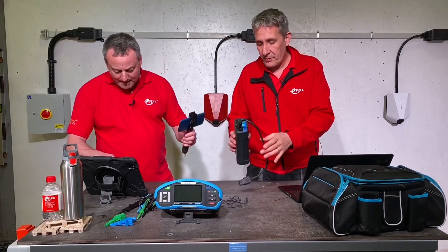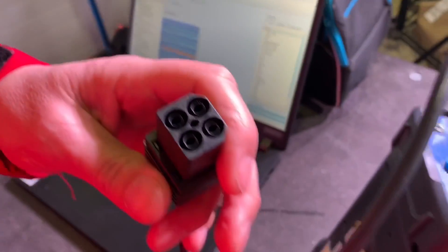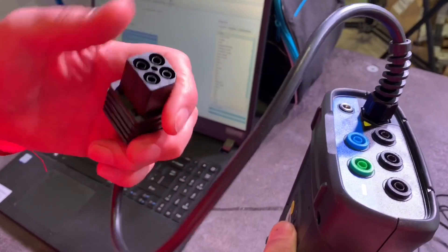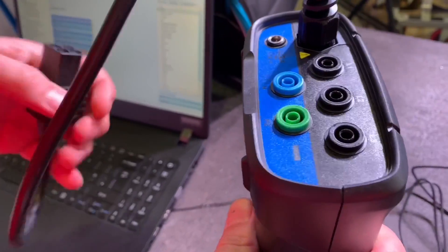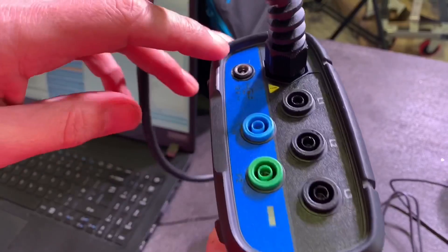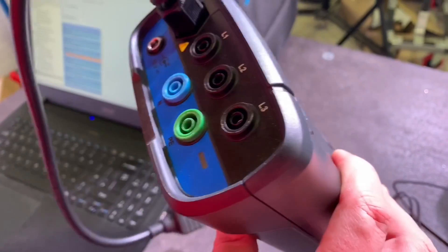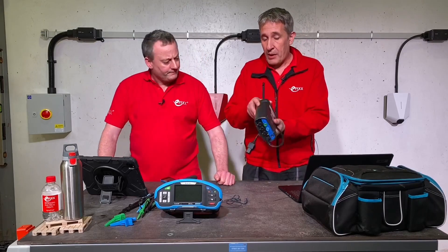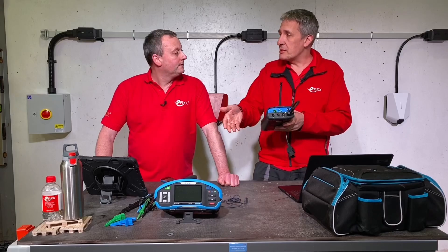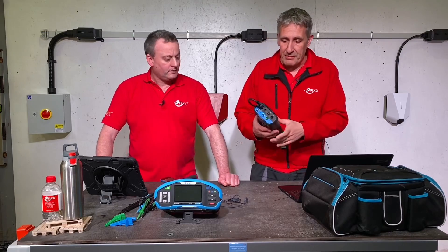So we've got the ability to put the five probes in there through our three lines, neutral, and our protective conductor. And we've got the lead here that goes into the top of the Metrel tester as well. This is where you'd normally have your possibly three or four leads out the top of your tester for single-phase work. The box itself is battery powered and rechargeable through this port here - just connect a little external power supply to that. The communication between the two devices to do the relay switching is via Bluetooth, and there's no power switch on this - it switches on when it detects the Bluetooth signal from the device and powers down when it no longer has that, so you don't have to worry about batteries running down.